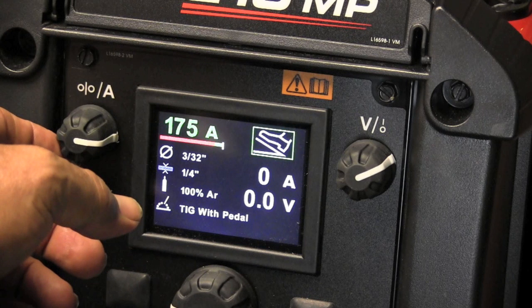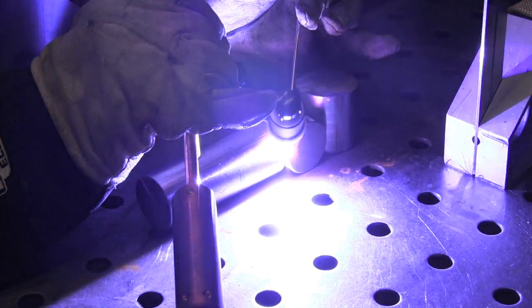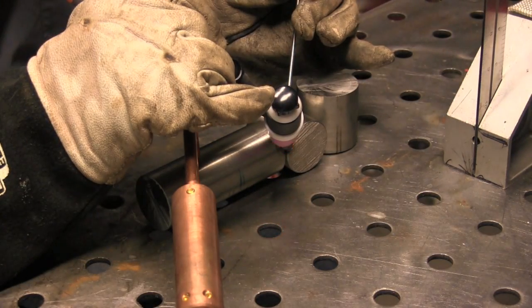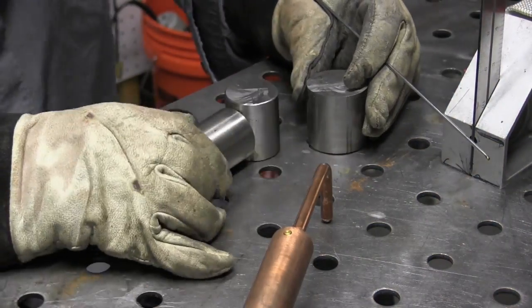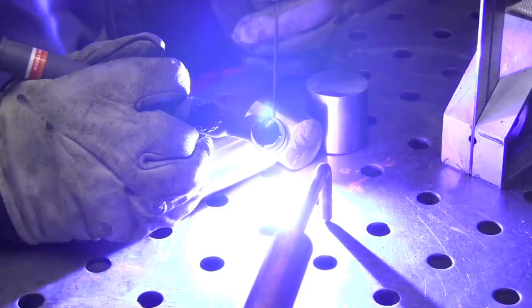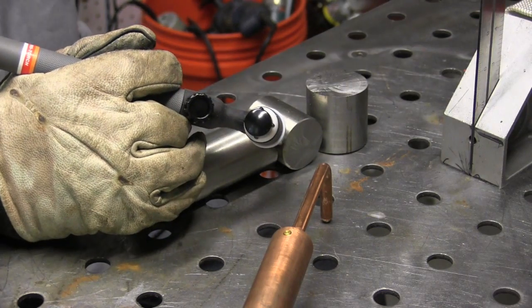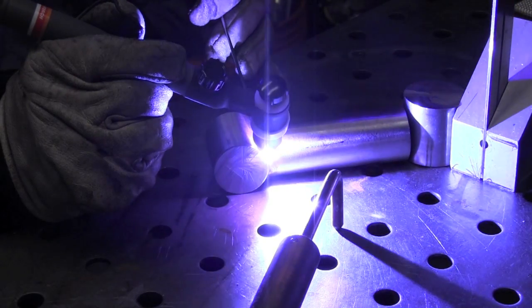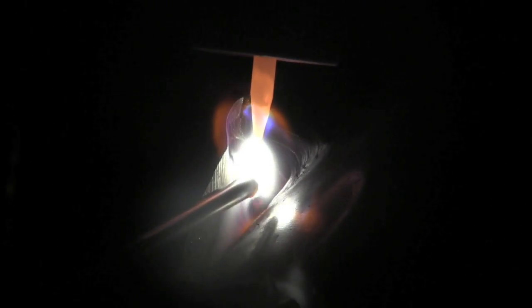Let's do a little TIG welding here. 175 amps is max on this machine when you're TIG welding on DC. I'll get a couple of tacks on this piece. The inch-and-a-half gives the right radius and diameter for the mandrel — the male part — and inch-and-a-half is also the right minimum radius for the female part. I've got plans for doing several plate tests and pipe tests, and I want to actually be able to do some bend testing when I'm done to show that what looked like a good weld is a good weld. It's just a good learning tool — even if it's not an official fixture, it's still good feedback.